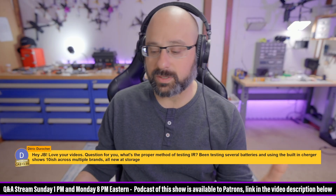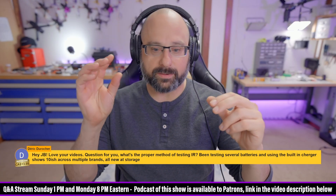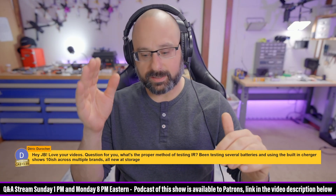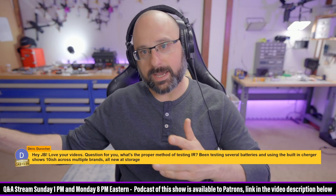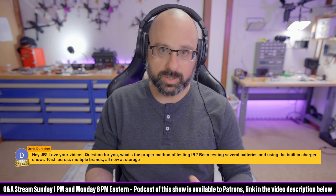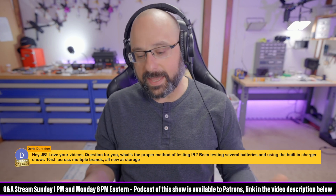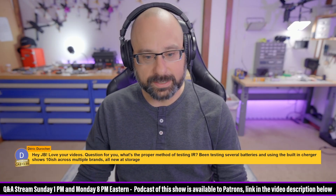What you can do is test the batteries and write down: 1500 milliamp hour battery, internal resistance — 8, 8, 9, 10, 8, 11, whatever. You write it down and make a database or spreadsheet with internal resistance for batteries of different sizes. Then you can have information about what a good and a bad internal resistance is.